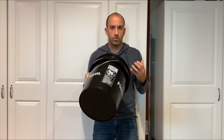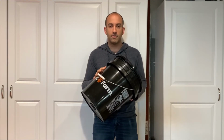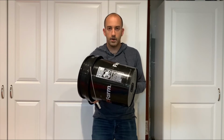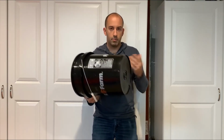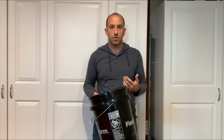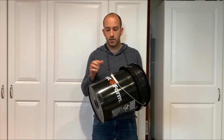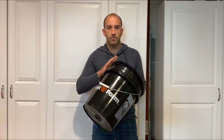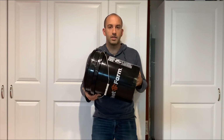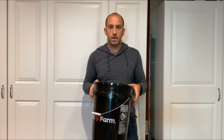Until I decide I really need it, I'm going to go with just a 5-gallon bucket of water and a submersible pump. Just run the pump through the lid, fill it up with water, and circulate the water through. I don't do a lot of continual grinding or batch work or anything like that, so I don't need to run this thing for hours at a time. I'll do a knife with it. So I think the amount of chilling capacity I'll get out of a bucket of water should be plenty to fit my needs. So just drill a couple holes and then we'll hook the whole thing up and see how it works.